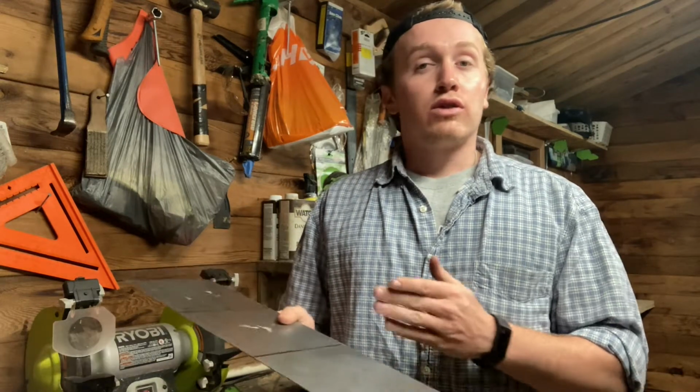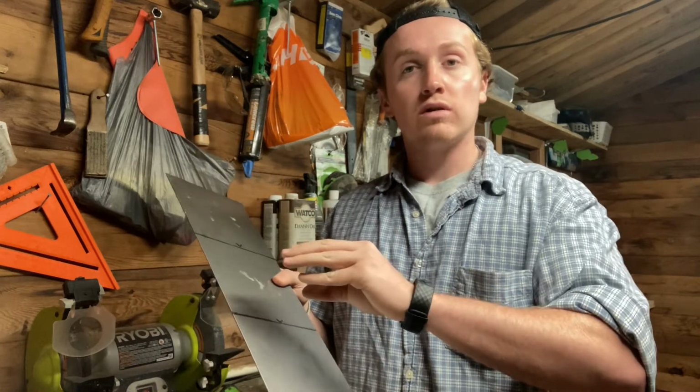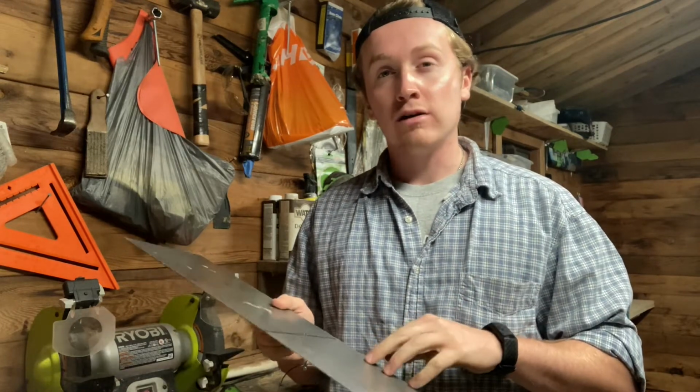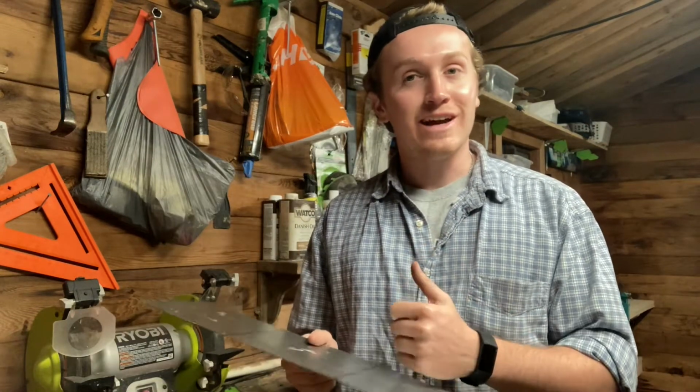So we're going to be building a 3-sided cube that you're pretty much just going to pivot the T-bar into the corner of it. And because it's metal on metal, there will be a little bit of wear, but this will wear before the hardened metal on the T-bar will, because this hasn't been tempered yet. This is just stock steel, and so this will be more malleable than the T-bar. And if you make this out of wood, the wood will be more malleable than the T-bar. So you'll be hurting something that's more forgivable to hurt, and you don't care about this if the point of this is to get damaged.